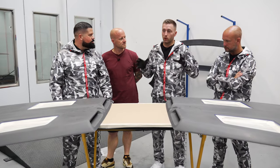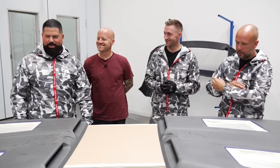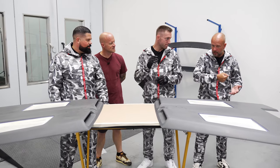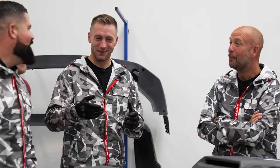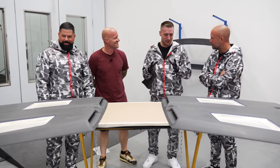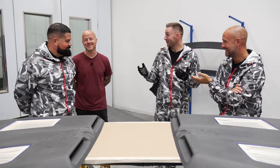So just a quick explanation about what lacquering in general is. In general, lacquering is top coating — spraying the clear coat. Use a small nozzle, set a good gun to get a good flow, nice gloss. Is there any guidance you can give us on how close we spray? A hundred percent. First of all, it depends on the spray gun. They've got beginner spray guns — little Fisher-Price. My first spray gun. In general, about the speed and distance, it's some kind of feeling. You have to adjust while you spray, with experience.